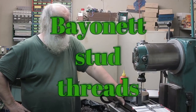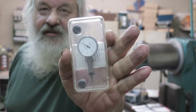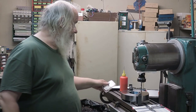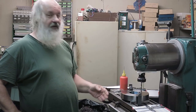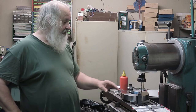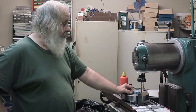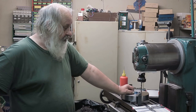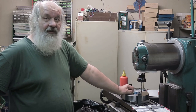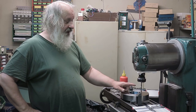Okay, I have been dancing around this piece of iron with this dial indicator. It was attached to this spindle. And there were two effects on this one. First of all, the rain stopped. And then this one is now centered with this taper. So, yeah. Well, the next thing I'm going to do here is to drill and tap M10